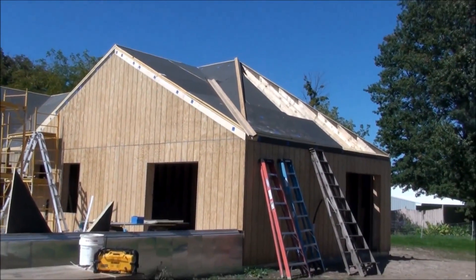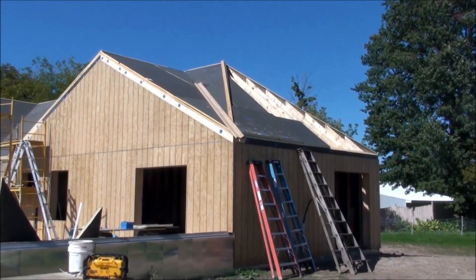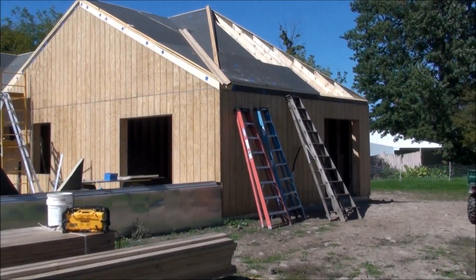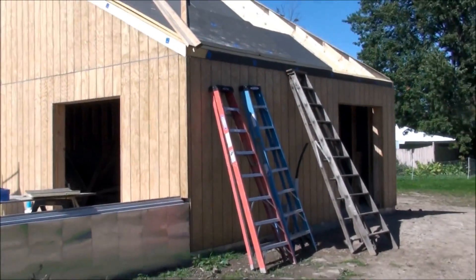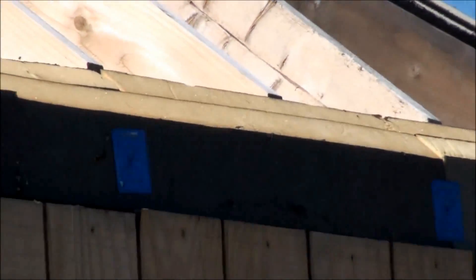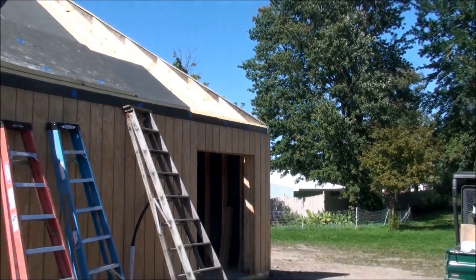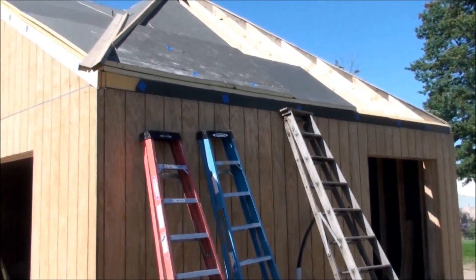As I mentioned before when I built the walls, I put two layers of polyisocyanurate rigid foam board insulation and staggered the seams all around the walls so that I could create a nice seal. At the top of the walls you can see the insulation was stopped right up there at the very top, so it's continuous all the way underground right to where the roof attaches, where the rafters attach.